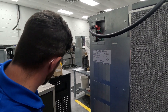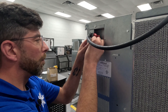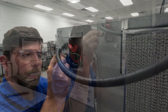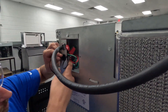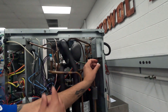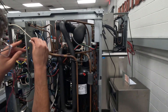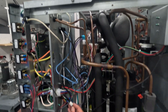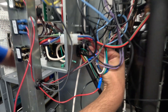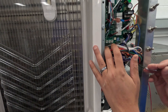Now it's off. But we don't want to be cutting our wires. I'll route my wire. This can get hard as you're going through, but there's a hole right here that I'm going to go through. What we're trying to do now is route this to the control box somehow. So we're going to pull our wire through, and I'm going to come in through this empty hole here. You want to do all this with power to the ice machine secured. So now you'll see that I'm through.